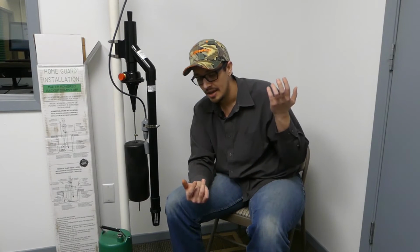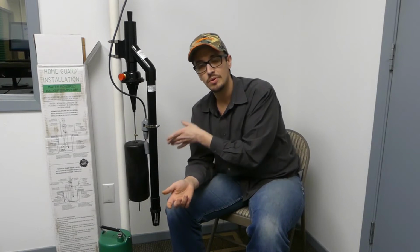So I think that it's pretty important to go ahead and consider just installing one of those to eliminate the risk. So let's talk a little bit about performance of this guy. Most of your typical sump pumps are not doing terribly high flow unless you're in a really troubled area. Your typical sump pump is probably doing anywhere from 15 to 35 gallons a minute, and this particular pump kind of falls right in the middle of that, being able to deliver upwards of 20 gallons per minute at peak pressures. So this system is very dependent on pressure.